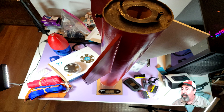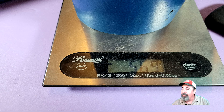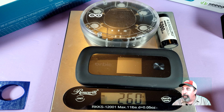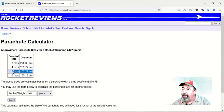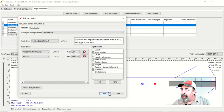We need to check out each of the rocket's components. Every piece needs to be weighed, and the rocket's center of gravity needs to be one or more calibers ahead of the rocket's center of pressure to fly stably. The completed rocket will weigh approximately 2,400 grams, or 3,000 grams including the motor. James at Rocket Reworks has one of these Aerotech I-500 T-14 DMS motors on hand. Thrustcurve.org says this rocket on that motor will fly to about 1,000 meters. Rocket Review's parachute calculator indicates that my 72-inch parachute will bring this bird back at a safe speed. Open Rocket is a useful tool to dial in the flight profile for the specific weather conditions on that day.